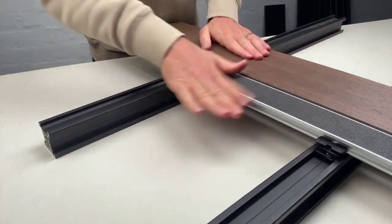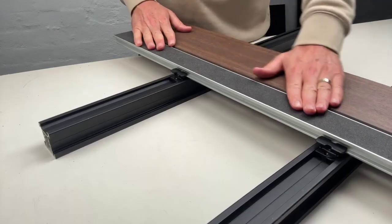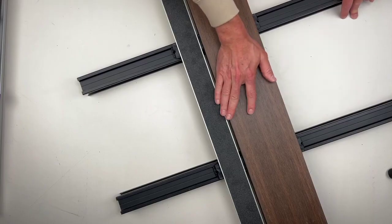But you can see now it creates incredibly high slip resistance there. It's the same height as my decking board. It's a seamless finish. So it provides a perfect 1/4 inch gap, a 6mm gap that is, and that's the A840 grip strip. So in summary, you don't need to worry about how to calculate how many screws or brackets or components you need. The deck planner will calculate it for you.